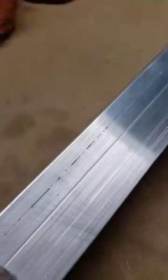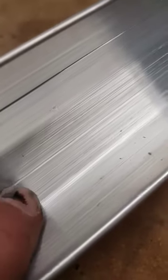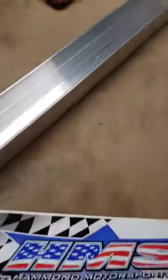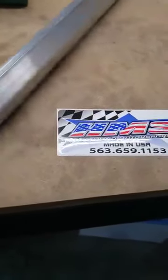If you look at this as well, you can see right there by my finger — you see that groove in there. So, you can drill it. Same thing here. There's a groove, and there's a groove right there in the center as well. If you use the DeWalt piloted drill bits, now you can drill it nice and squarely.